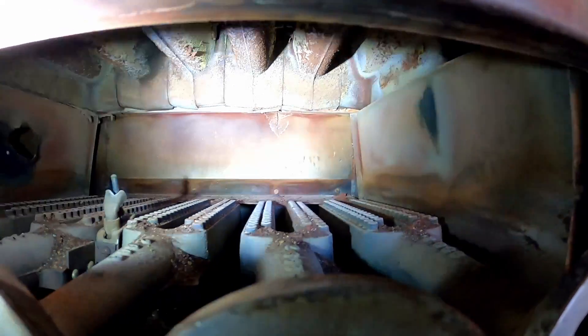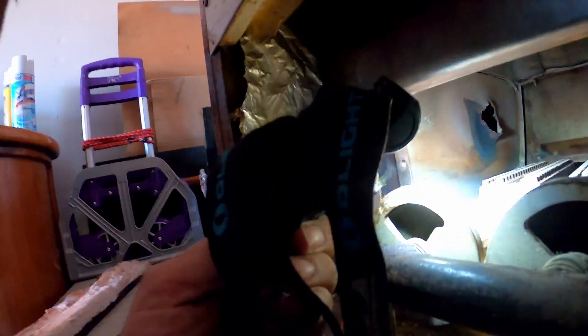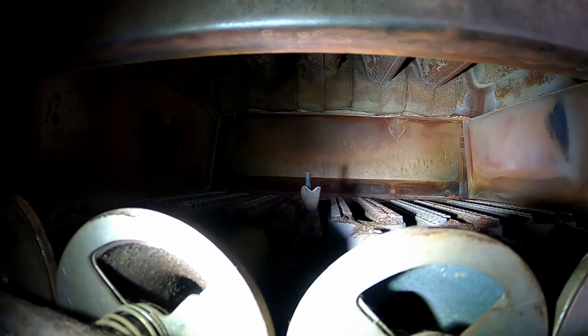You can see there's a crack in the back, straight back. But that burner box is burned through. And there's another plate right here — that other plate is starting to burn through as well. The boiler is done. That's why I'm getting improper combustion most likely. It's not supposed to be like that.